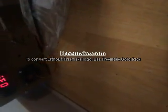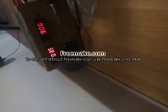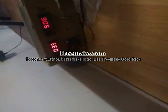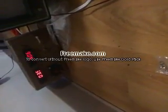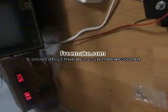Yeah, 9 is close to 10. If you divide anything by 10, it's going to move the decimal digit over. And that's why it's close to our resistance on it, lower than 1. With 3.3 kilohms, it's doing 3.5 milliamps. I need to explain why we get that. It was close to 10 volts.